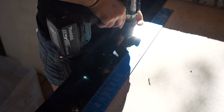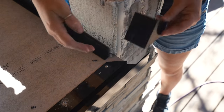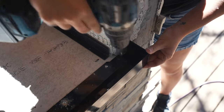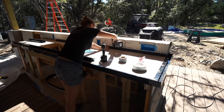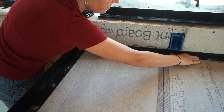They make it very simple to not mess up. I just recommend pushing forward slightly when attaching to make sure it's seated all the way against your cabinets. Every seam will need to be taped together with some duct tape — so all the corners as well as butt joints where two spans are spliced together. Here is a level-up option if you really want a pro install: if you have an overhang, you can cut a small little piece with a miter that will wrap the overhang around to the back side, which looks super sharp. For the back where the concrete will meet the wall, a run of the flat section goes in, just as easily by screwing down the bottom while making sure the top is resting against the wall. When it runs into the overhang material, you can cut back a section on the bottom lip so that they don't interfere.